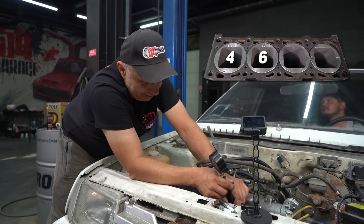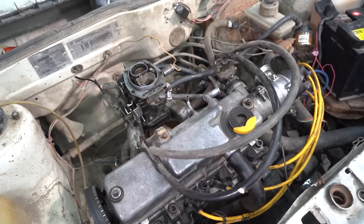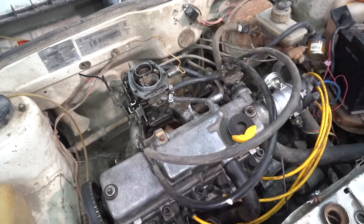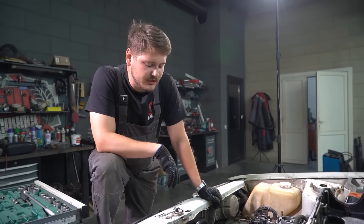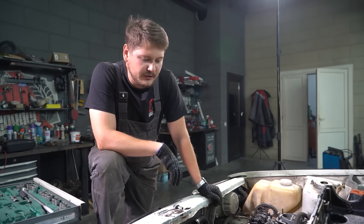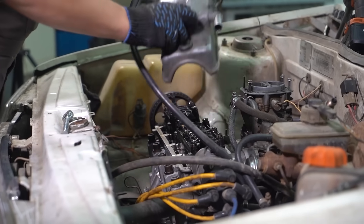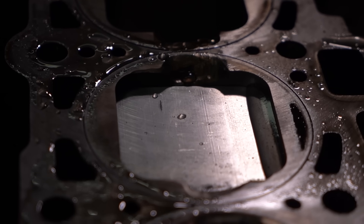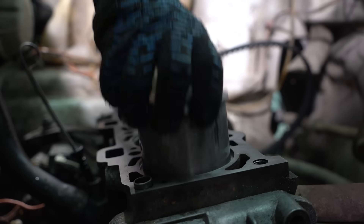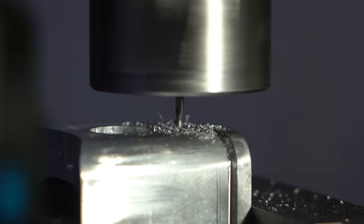The compression figures — 4, 4, 6, 0, 5 — are awesome. We've decided to remove the head as well as the pistons to see what has become of the rubber piston rings and what condition they're in, and most likely we'll be fitting one extra rubber ring to each piston. We were unable to start the engine the first time around because there wasn't enough compression, so we've taken everything apart, had a look, inspected the parts, and found a few curious issues.